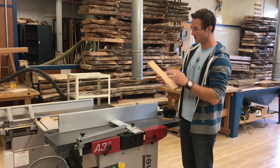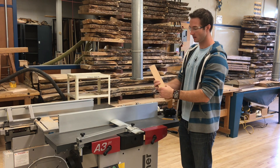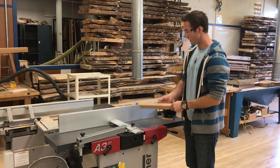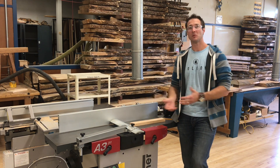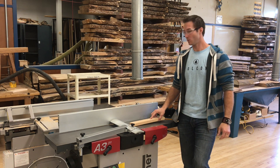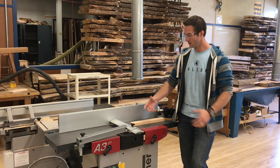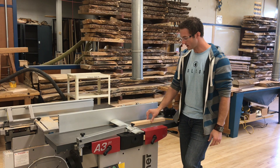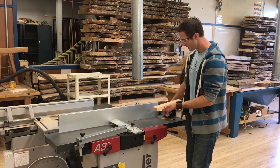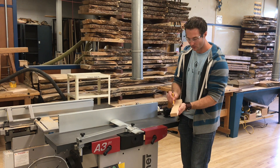When we're doing our first face, we have to decide which face we want to do. We know that our face is the widest surface of the board. We use a little saying: 'stable on the table' — whichever way this board seems to feel the most stable on the table, that's the one we're going to use.